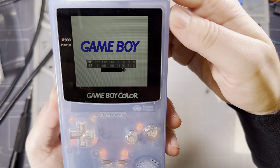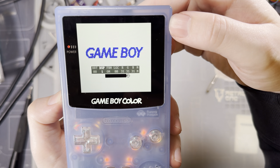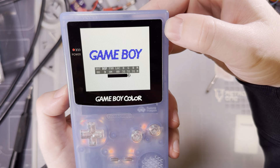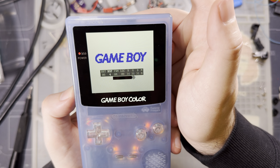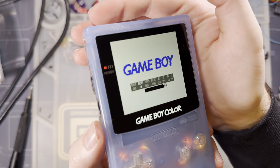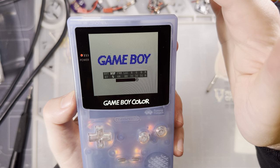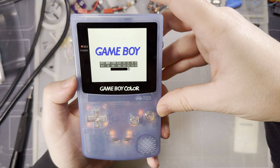First option is the eight levels of brightness. Next is DSP, which gives pixel grid modes: mode 1 gives both vertical and horizontal lines for pixel grid emulation; mode 2 gives zero lines — perfect 4x integer scale; mode 3 gives vertical lines only; mode 4 gives vertical lines that are inverted or blended — looks pretty good, and if I were to use one that's the option I'd pick; mode 5 gives vertical lines that are thicker and darker. I'll leave it on mode 4.